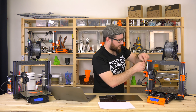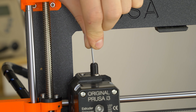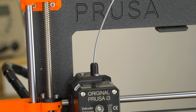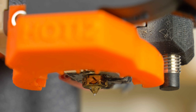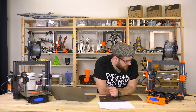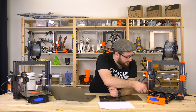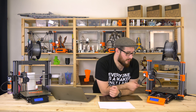The printer asks me to insert the PLA into the top of the extruder and confirm. Now it's loading the filament — you can watch until the filament starts to come out from the nozzle. The filament is loaded and you can remove it. Be careful not to touch the nozzle — it's at 200 degrees Celsius, which will burn you.